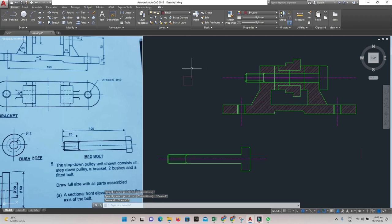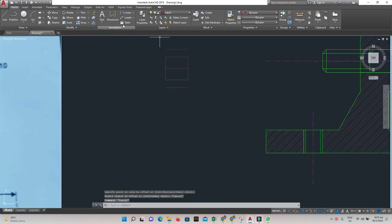Now it's time to do the thickness. We're going to add, all right, so let's just draw a line here like this, and I'm going to offset 10 on either side, 10 and 10, yeah, all right, and then we'll just fillet the edges. So we're going to fillet, all right, filleting with the curves as well.